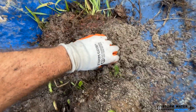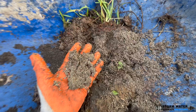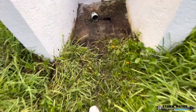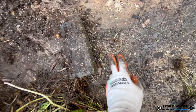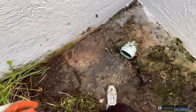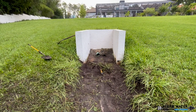Take a look at all this roof shingle gravel — all these granules you see here in my hand in this wheelbarrow. That's all from the roof. That's the roof shingle gravel that makes its way down your downspouts into the drainage system and comes out here at the discharge end. That's a good sign because it means these drainage lines have nice pitch on them and don't have any bellies, because all the roof shingle gravel is gathering here at the discharge end instead of getting stuck in the main line.